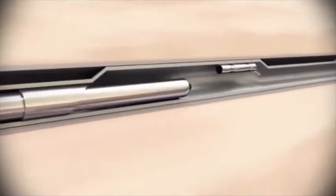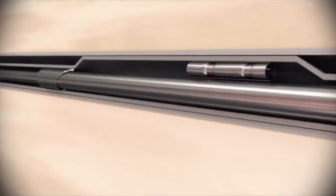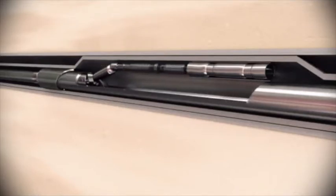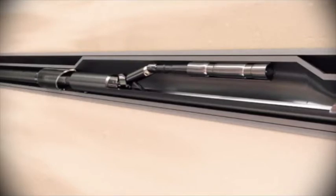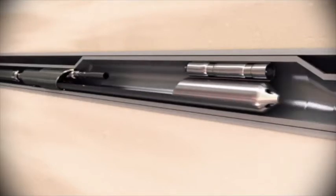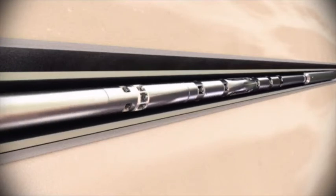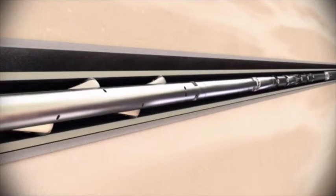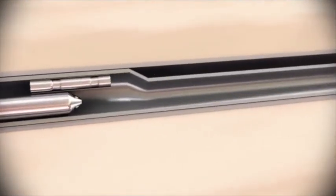In the video, we see the tractor. We can see that we catch the orientation sleeve with the kick-over tool. The kick-over tool kicks and then we get inside the mandrel to install the valve — a sequence I described already in my gas lift equipment training. We can see the wheels of the tractor, and the kick-over tool is attached at the bottom of the tractor.